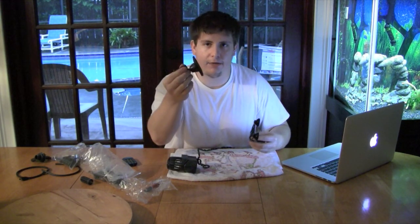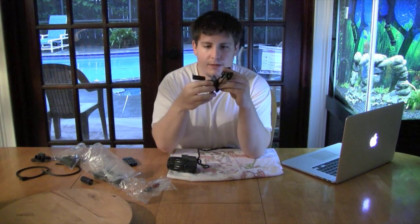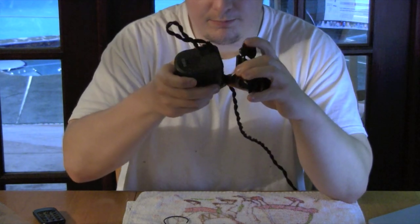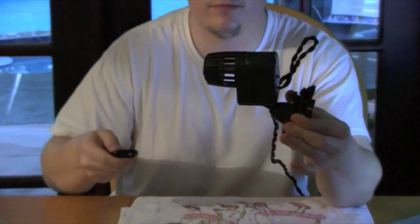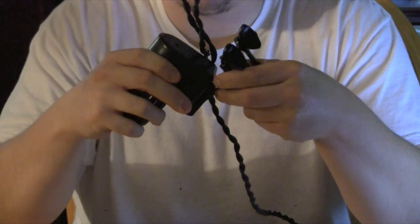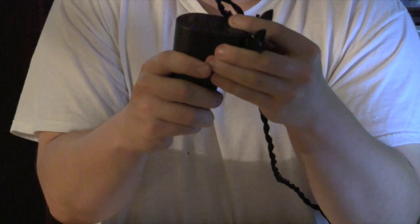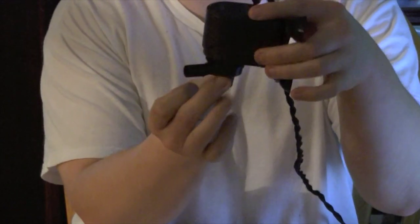This is what you use with your propeller-type system — it's kind of like an add-on piece. You take your regular bracket and slide it up, then put it on the pump. It doesn't slide in very easily. This is basically how it would look mounted. It's nice that they give you those extra pieces, because otherwise you'd have mounting problems. That's why it's a little more than just converting from propeller to impeller — you also need to swap the bracket. Without the adapter, this is basically how you'd mount it in impeller system mode.